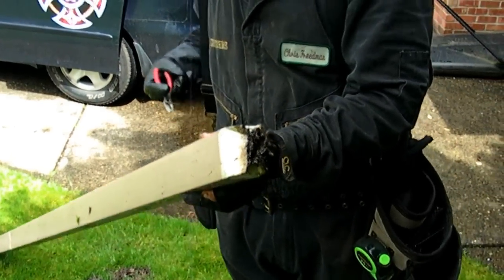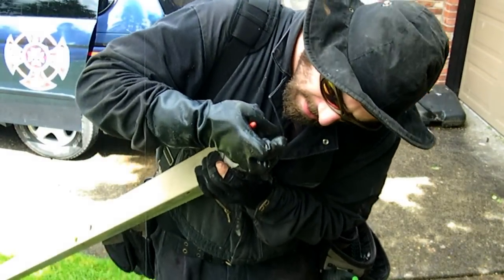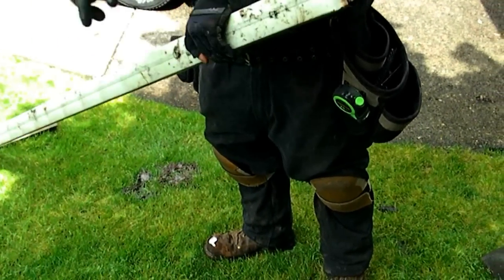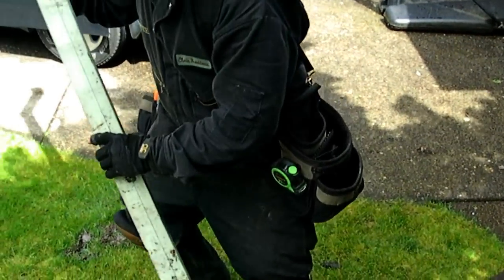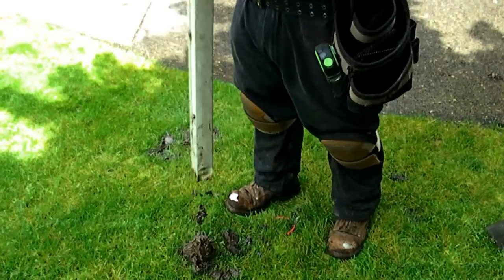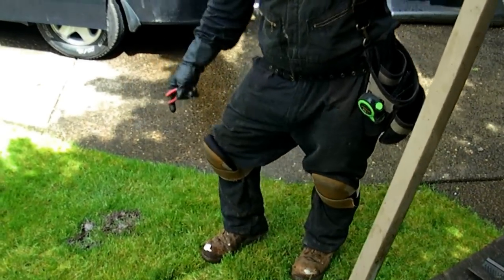We find larger clogs than that sometimes. It's like this is deliberate. I've seen that a number of times. Shake it out, buddy. It's like this perfect fertilizer. It seems sometimes impacted with mud several feet up into the downspout. That feels empty now. That's all it took. Just that little bit of six inches of mud in the bottom to keep the downspout from draining at all.